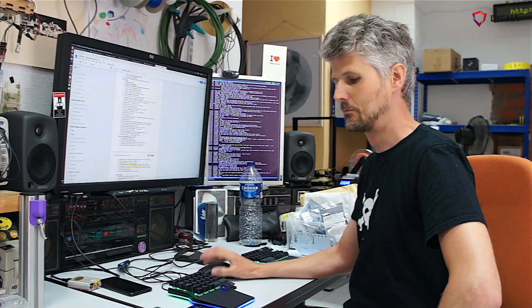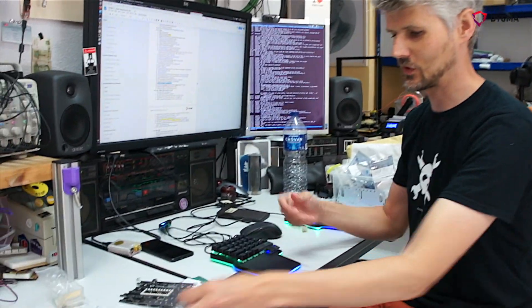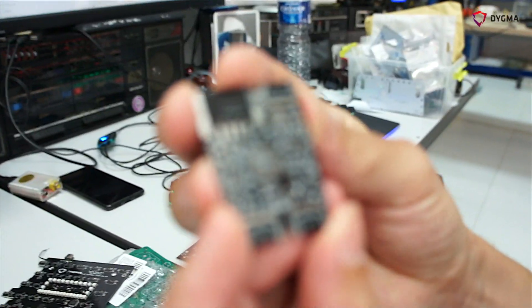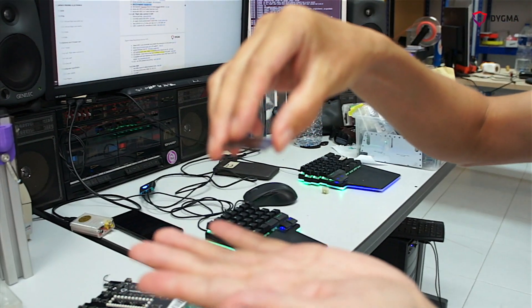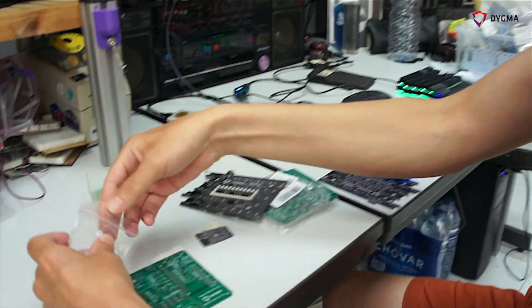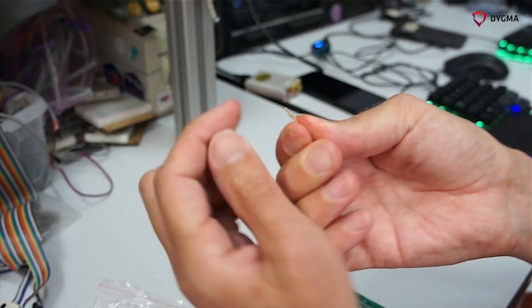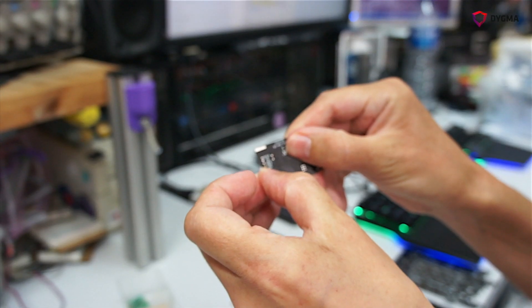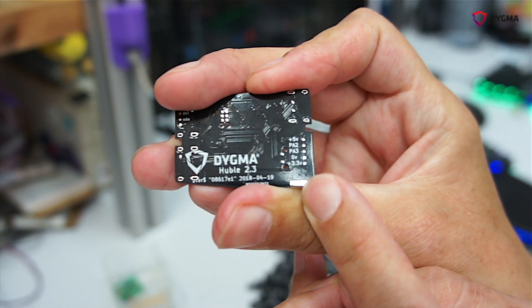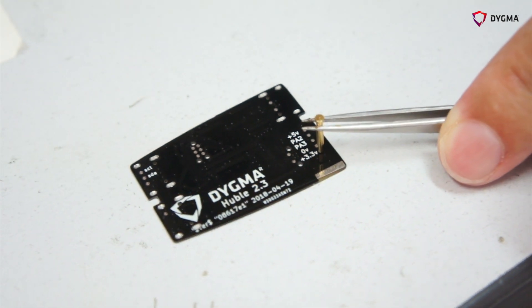In the Hubble, the microchip we're using runs at 3.3 volts while USB is 5 volts. So one thing in the specification is to check the 3.3 volt regulator is working correctly. On this circuit board, the test points are on the back side of the board so that after assembly you put it into a jig that has lots of pogo pins — gold-plated springy pins. The board goes in so one pin lines up with each of these little spots. You can see one is 5 volts and one is 3.3 volts — a pad that connects to the output of the 3.3 volt regulator.